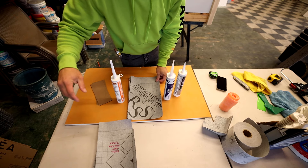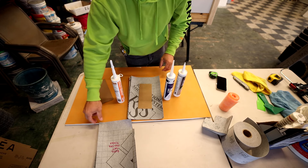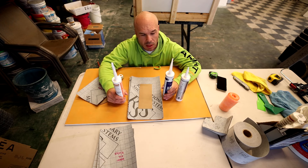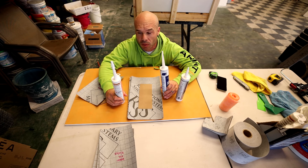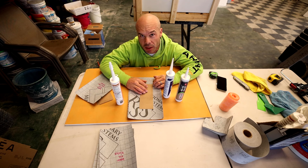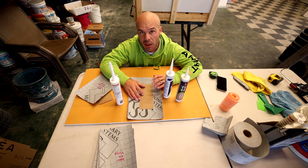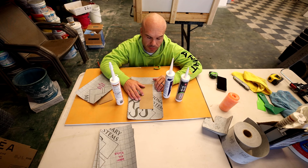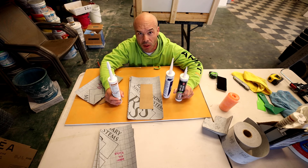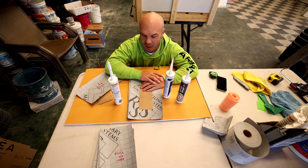What I'm going to be doing is taking a piece of sheet membrane, putting a piece of cardboard inside, putting sealant all the way around, putting another piece on it, sealing it up, and putting it immediately under water. The neat thing about these MS polymer sealants — MS stands for Modified Silane Polymer Sealants — they cure with the humidity that is in the air and they can be applied to wet surfaces. Since they cure with humidity, you can put the sealant directly under water as soon as you apply it and it will cure. You can also apply these sealants to wet surfaces like wet thinset mortar, and it seems to bond really well.